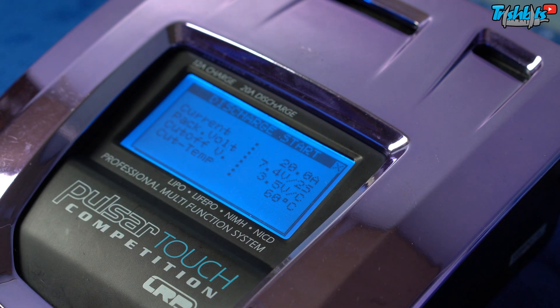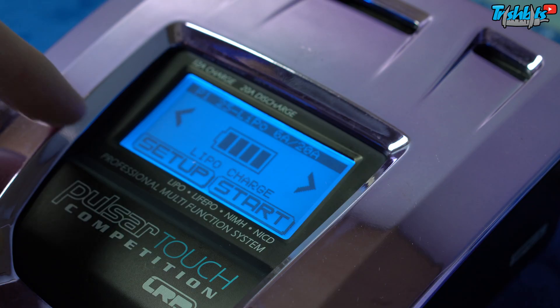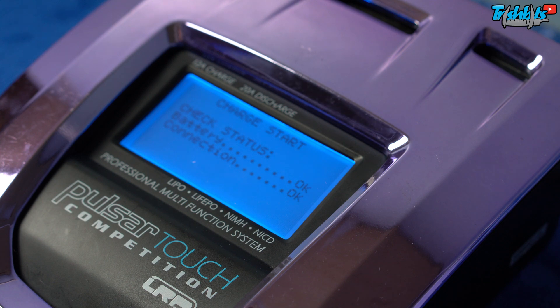So that's what you charge up to. You're going to discharge your lipo — get your charger on, put it into discharge mode. Some chargers do it at 2 amps, some at 20 amps; either way it's going to take it down. I'd say take it down to about 7 volts, then when you put it back on charge you can watch it work its way up to that target voltage and unplug it when it gets there. Some chargers let you set a specific charge target voltage per cell, and some have a storage mode. I have an LRP charger — I can set the exact number I want per cell and it will be fine.